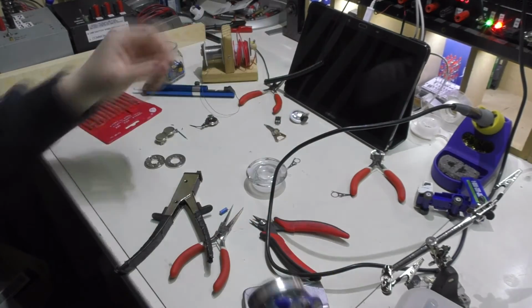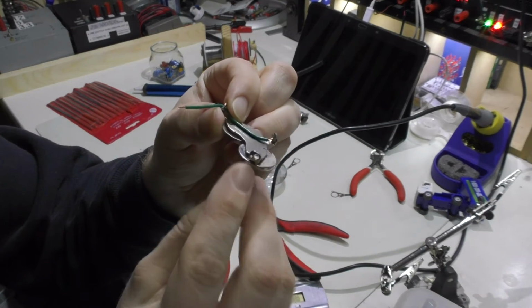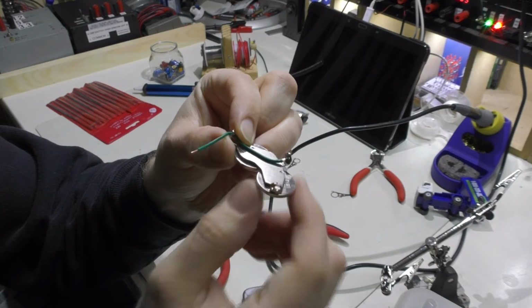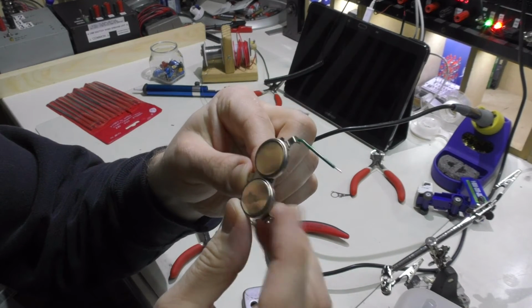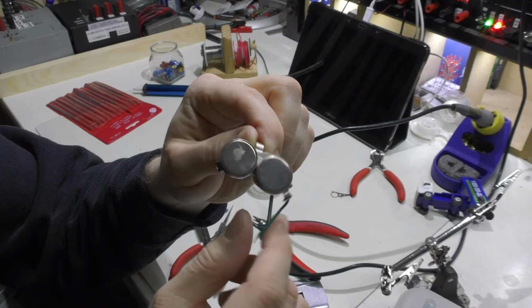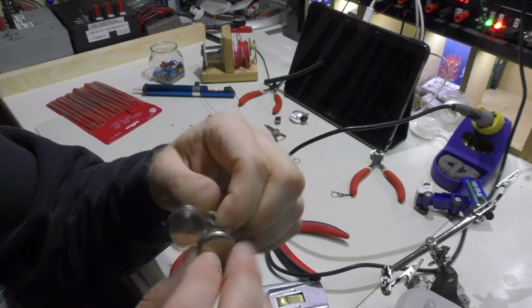We'll figure out how we're going to implement that momentarily. Another thing I figured out, the battery, I don't know if I mentioned or not, but I took the little tabs that were at the corners over here and I bent them in the opposite direction, so there's less chance of them shorting out, but you can actually fit 2 batteries side by side. Now this is going to give you the same voltage but double the capacity essentially.